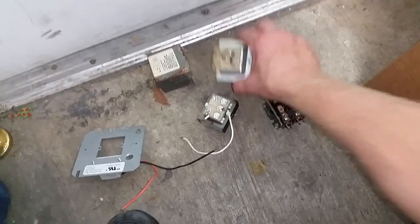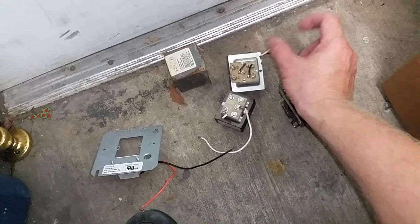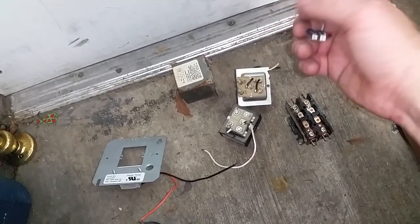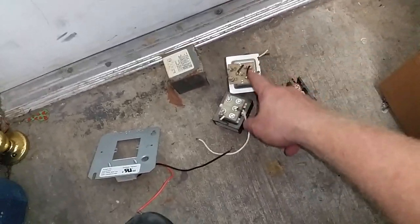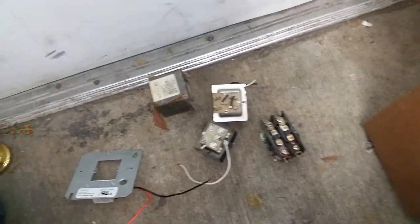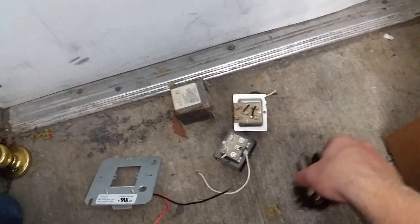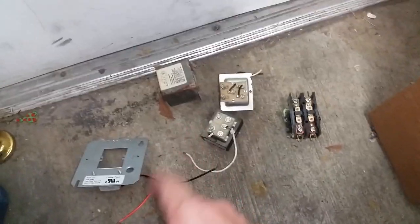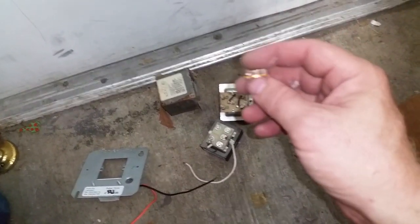And some of the better transformers have protection already built in, a little fusible link with a slightly different style of fuse, but a 3-amp fuse, and it protects that from happening. Blow the fuse instead of burning up the transformer. But if you have a burned up transformer, suspect your contactor. Probably a good idea to just replace the contactor before you replace the transformer, and that way it doesn't happen again, because most of the standard ones just come straight wired, no protection on the transformer.